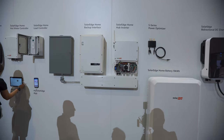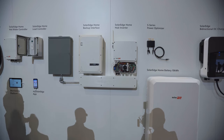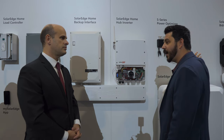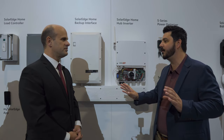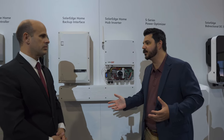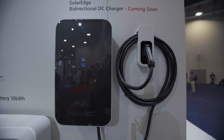You can always add backup later on. With an electric vehicle that supports bi-directional charging, you could have your Home Hub use the bi-directional charger and use your vehicle to curtail your evening usage, maximizing savings even more without even buying a battery. But it just depends — everybody's situation is going to be different, and what ends up coming from legislation will vary as well.